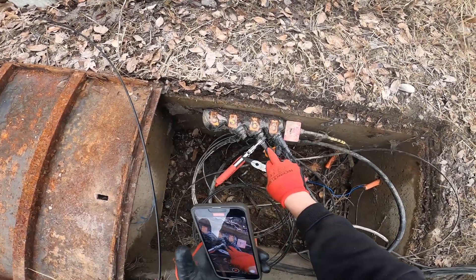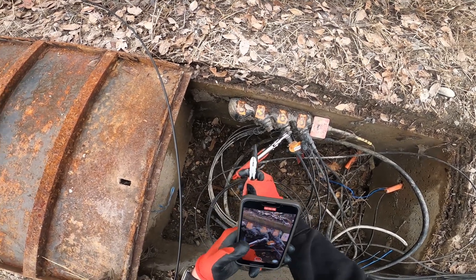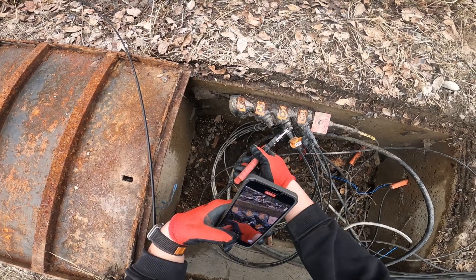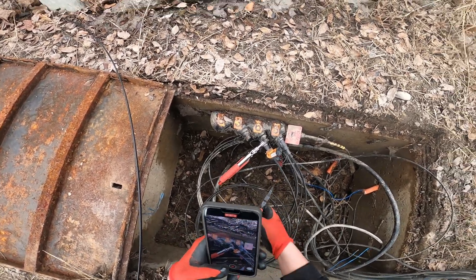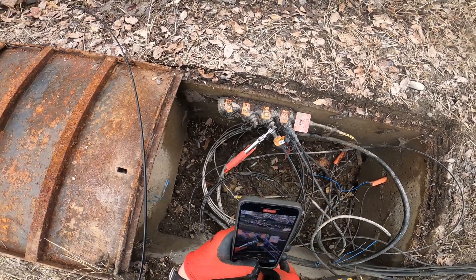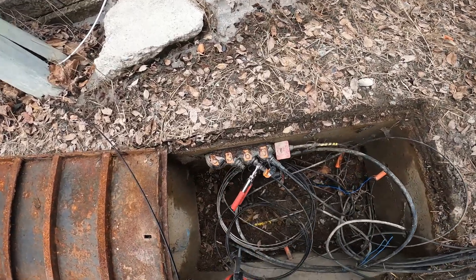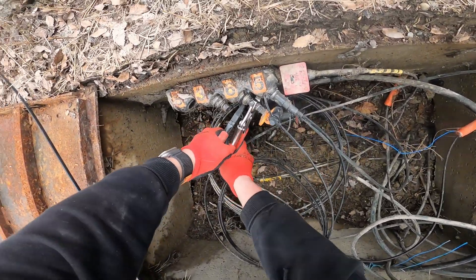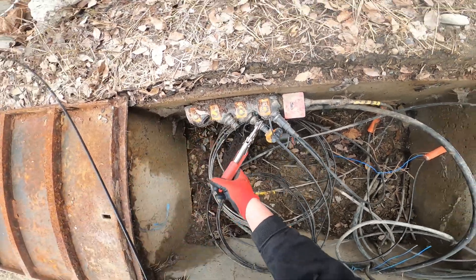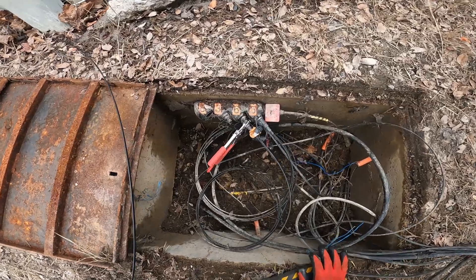This is the drop I'm trying to replace with a double, and it is completely seized in here — it's moving the whole socket. I'm trying to hold the socket while I pull it, and it's just not budging. I've never seen that before. I'm going to have to cut it and then use ports four and five.